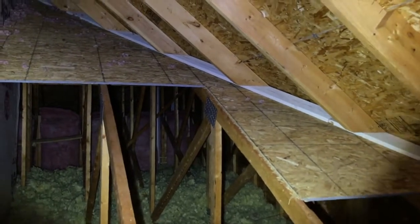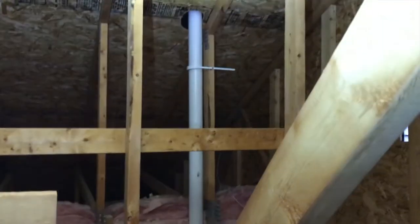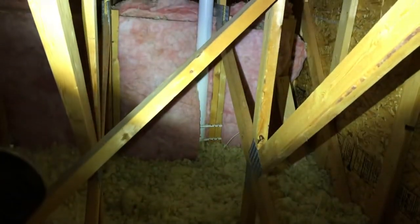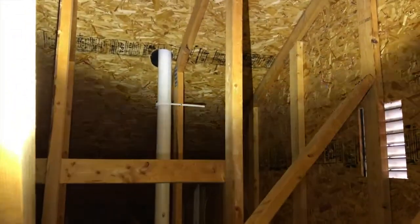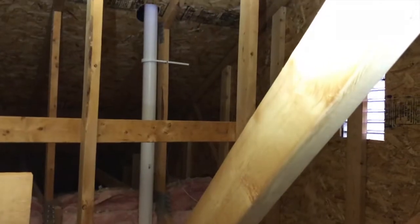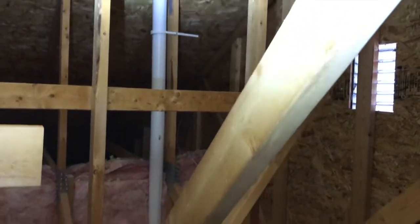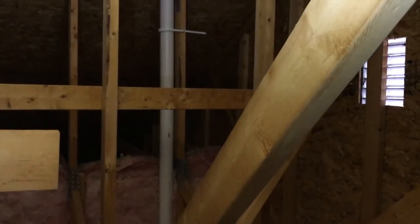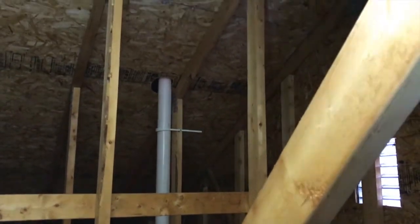I'm going to maneuver over to a point where you can see our pipe way back there. Here is a better view — you can see the white pipe and I'm going to get closer for a better look. Here we are much closer to the radon pipe. The bottom portion comes out of the ceiling and is strapped to the boards and continues up to the exit point. The upper portion of the pipe is also strapped to the board. What is not installed on the pipe — from the lower portion all the way to the top where it goes through the ceiling and out to the roof, there is absolutely nothing else installed along that pipe, which is a clear indication that we have a passive system using stack effect to pull radon gases from the sump pump chamber up through the plumbing and out the exhaust.